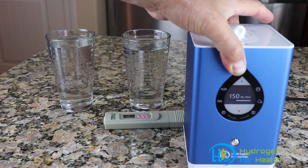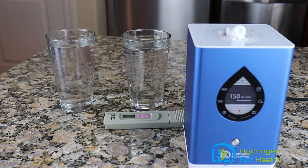Hydrogen generators need pure water — water that is free of any contaminants. Any contaminants in the water would adhere to the internal parts of the generator and shorten its lifespan. Also, any minerals in the water can be electrolyzed and, depending on the mineral, can generate other gases that we don't want to be breathing. So it's very important to use pure water in your hydrogen generators.